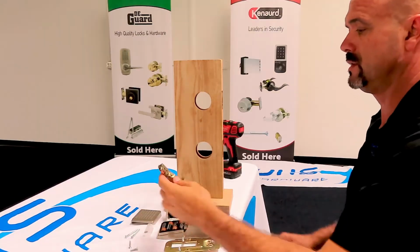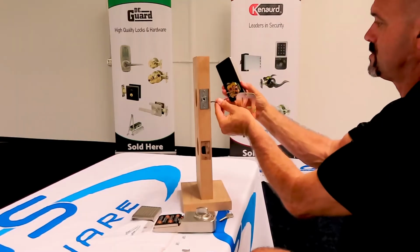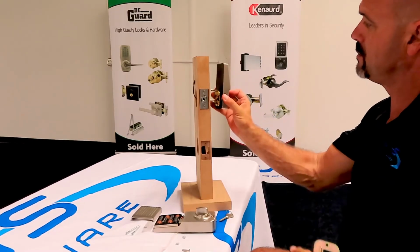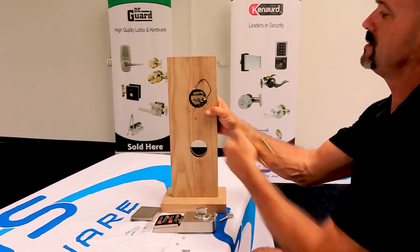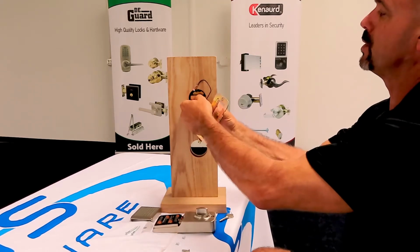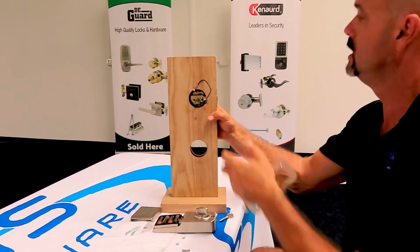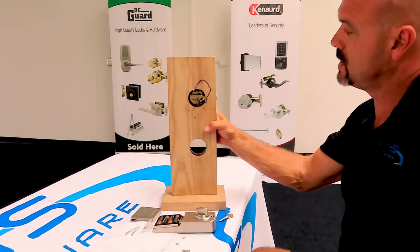The first thing we do in these situations is put in the deadbolt. Wire you just feed through the bottom below the latch, put the tailpiece through. You go ahead and test it. The instructions do say that this needs to be retracted for it to program properly when you're done. Make sure you have it in the right orientation.